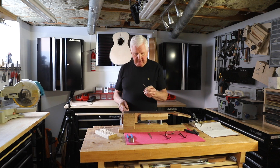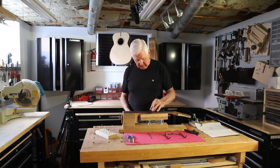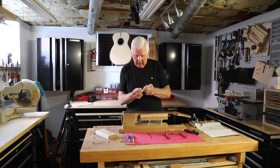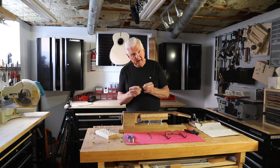What we have done — in the previous video you saw me cut each one of these frets all along here. Now what I need to do is nip the end of this and then file it.